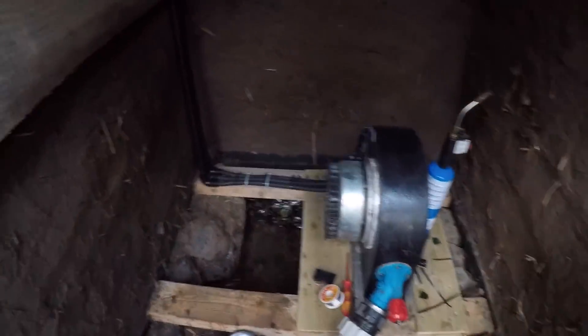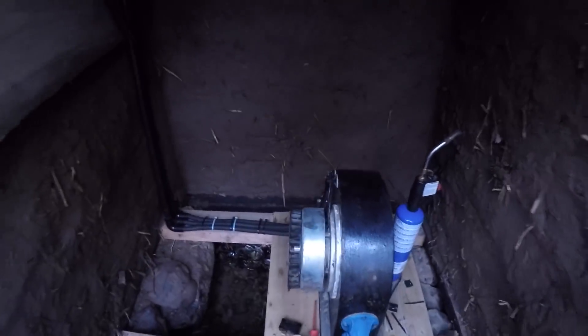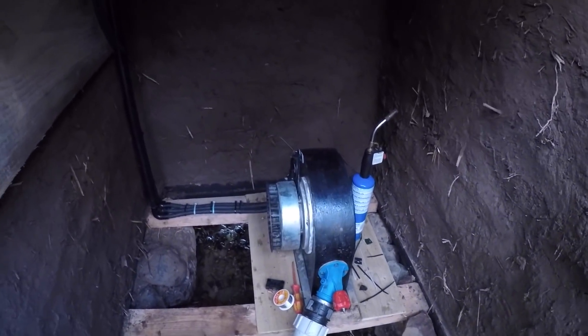I'm getting a bit of this hooked up here. I've got three phase coming out of the alternator going down through conduit, along there and up the wall — it's really dark so you can't see much, that's why I haven't been filming. I've got my three phase wire coming out of there, going down in conduit and up the wall. I'm using the torch at the moment. That's going to terminate into a terminal block, and the armoured cable will come up the wall and connect into that as well. I'm going to solder that — not filming it because it's too dark in there.